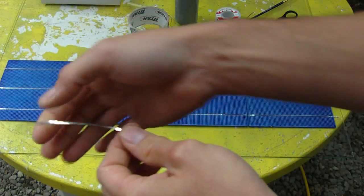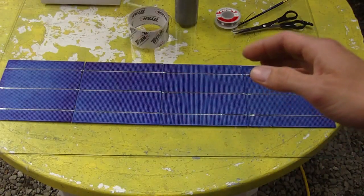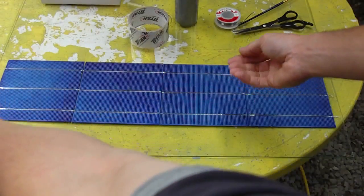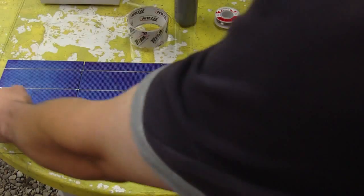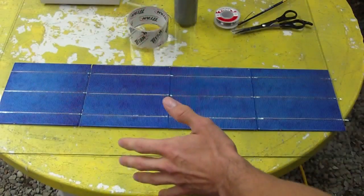And so what you want to do is move this very carefully without letting these fold or sag. You don't want any sagging when you go to lift these. So the best way is to grab it. There's a few different ways. You could scoop it up with some wax paper, or you could grab it like this. This is what I do, and just slightly pull up, and then I put a little tension between the cells, and then just turn.